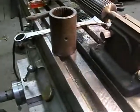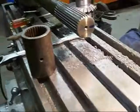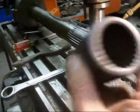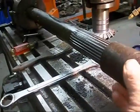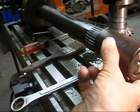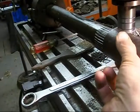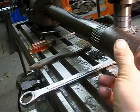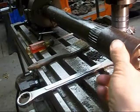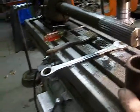There, we're done with our last pass. We slide this back, tailstock off, take our coupler — and it slides on there just like it's supposed to. I had to make an extra pass of 10 thousandths all the way around on it, but it's nice and tight, no give, no play back and forth, just a slight movement. That's pretty good. So now I turn it around and do the other end.